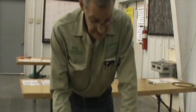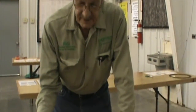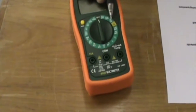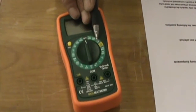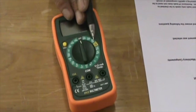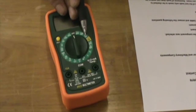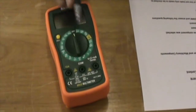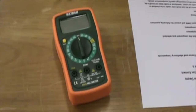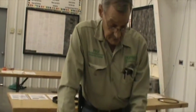To test 10 amp delivery, the meter must be set to the mA scale. Milliamp is for milliamps, one thousandths of an amp. So if you're going to test 10 amps, you do not set it on the milliamp scale — you'll burn your meter up or damage it. The acronym for DMM is digital multimeter. That's correct, this is a digital multimeter.